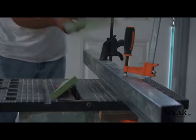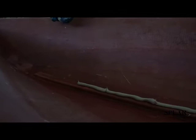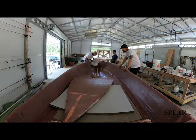After the sections were cut, the bow piece was glassed on the bottom with one layer of 1708. The bow piece was glued to the stringer with B39. Once the structural material was finished laid up in the hull and the stringer was made in the bow, we glued the fitted core into the hull.